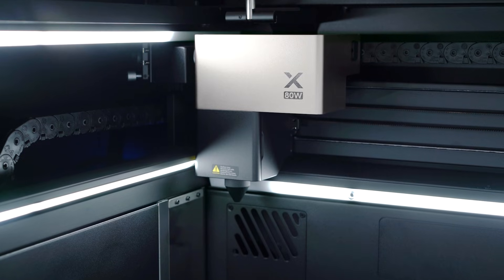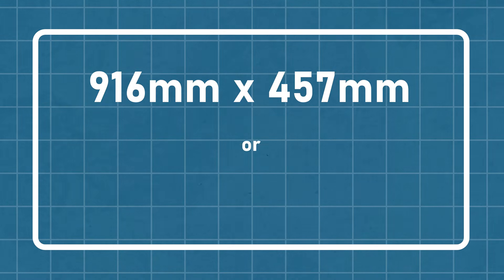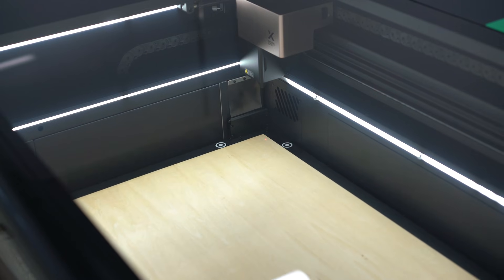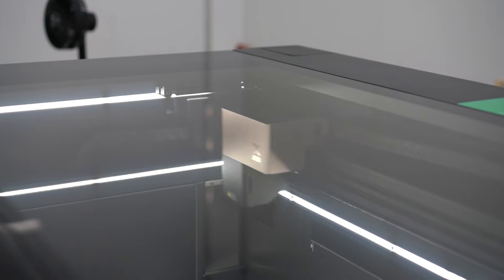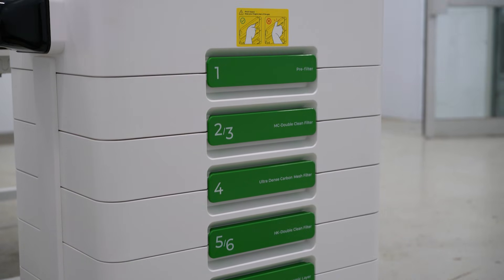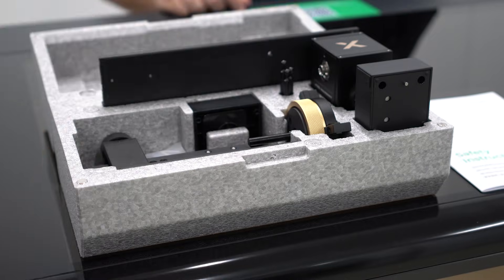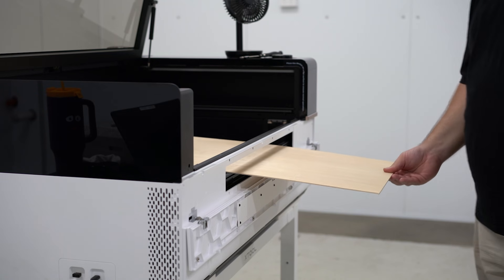The P3 is an 80 watt laser cutter — a nice level of power that lets you cut things quite fast. It has a 916 by 457 millimeter work area, a very generous bed height, and a max speed of about 1200 millimeters a second, which is pretty decently quick. If you pay extra, you can get goodies like an AP2 Max air filter so you can run it indoors, as well as a rotary cutter and conveyor system, which increases your work area to technically infinity. There are lots of options for gantry style laser cutters in this price range and they all have different trade-offs — bigger work area, more powerful laser, quicker gantry system.